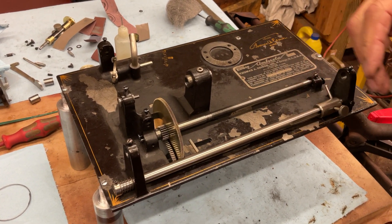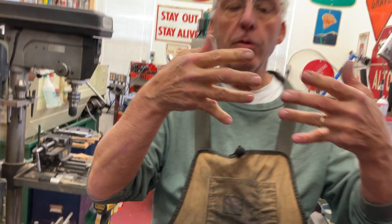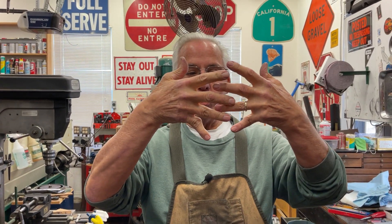We will get the rattle out of it. That's because the gears on this are set like — these are the gear teeth — they're set like this, not like that. We will put the graphite green grease stuff in there and that'll soak up the distance and it'll quiet it down and help it run a lot smoother and quieter.